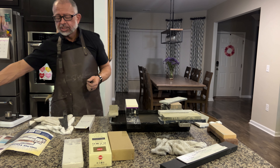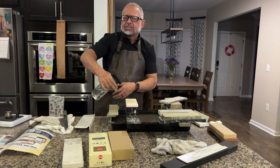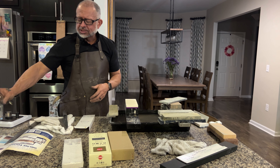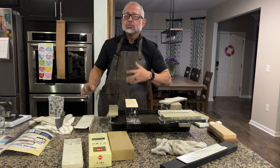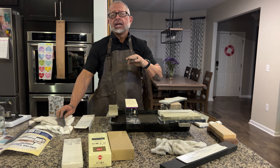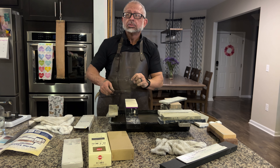Let's go ahead and put a little water on it. Hap always has this really cool pressurized spray water bottle that he uses. One thing I would tell you not to do: you would not do edge-leading strokes on anything higher than 8K — 8K is where you stop doing that.